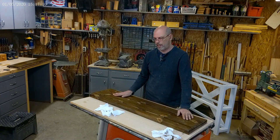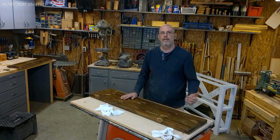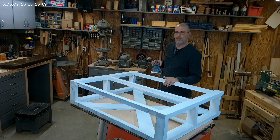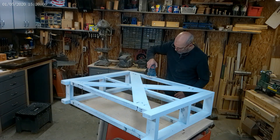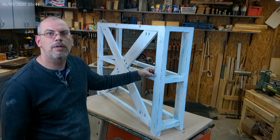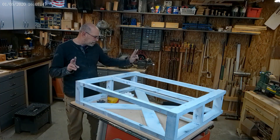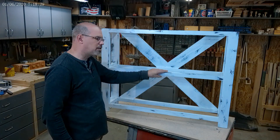The top's done, the shelves are done — I just finished wiping off the third coat, this is really smooth. Next thing we're going to do is distress the table itself to match the customer's other furniture — a little bit less than you normally would, because as we put the wax on it with the steel wool that will take off a little more paint as well. That'll really bring out some of those not-so-dark spots, but they will get darker. We'll put a coat of wax on this, assemble it, and this one will be done. The paste wax is going to give this a silky smooth finish.